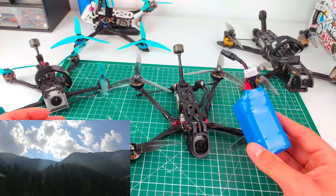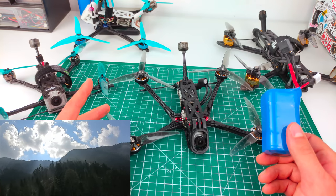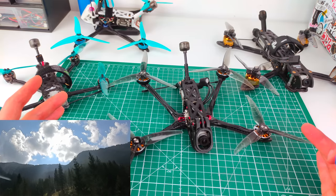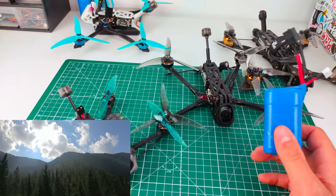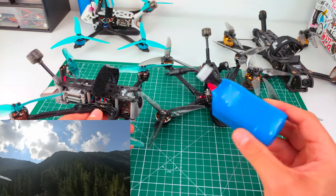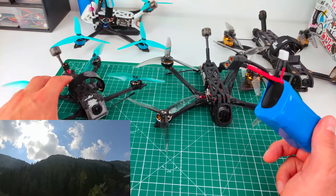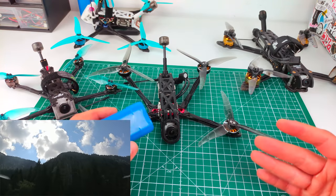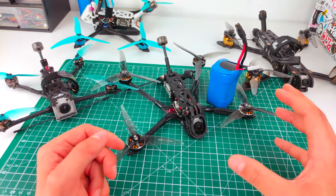On this setup, which is really not very amp-hungry, 30 amps is more than you need. You can do real punch-outs without the battery sagging. It's a 200-gram battery on a 200-gram quad — quite heavy for the quad — but the large disc area supports this big pack without overloading the props. A micro long range can also carry this pack, but that's a 200-gram battery on a 160-gram quad, so you lose more performance. This light five-inch is the sweet spot.